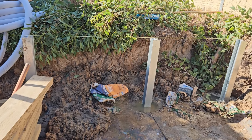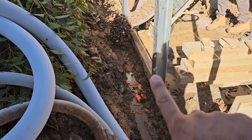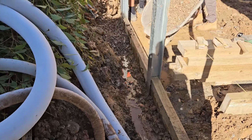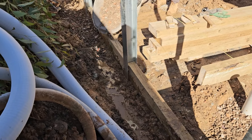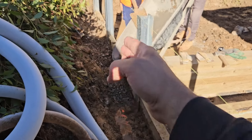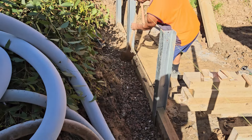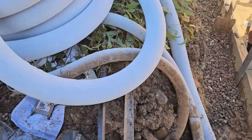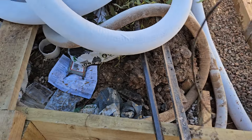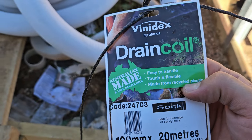For the first step, we make a channel in the first course, then cover with a few pebbles to raise and level up the pipe. We close under the first sleeper. If there is rain and water going down, it's not going to the backyard turf side — it just comes through and goes to the drain system. We level it, then add aggregate with a slope, and lay the 100mm ag pipe on top of it.